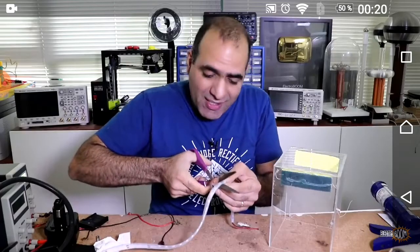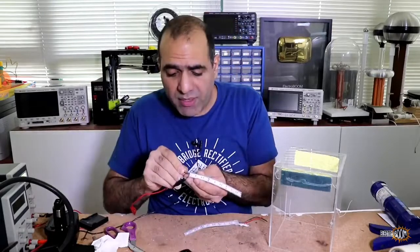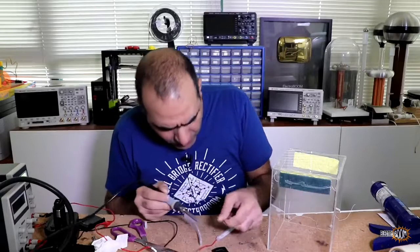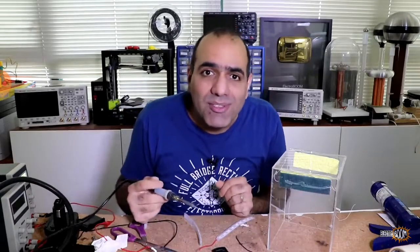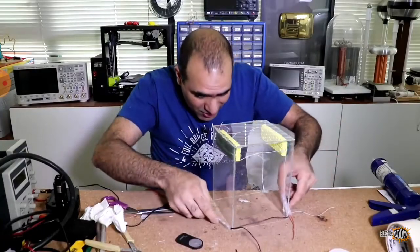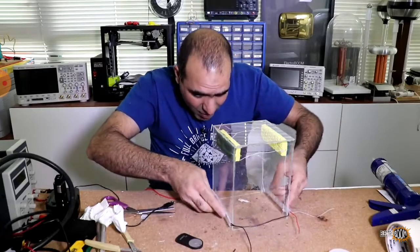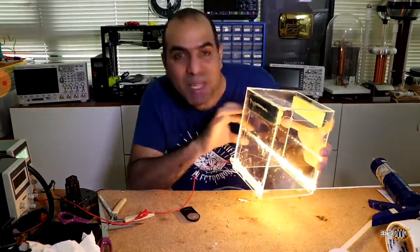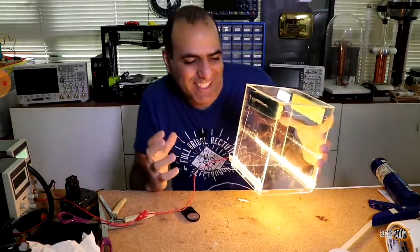So we cut two pieces the length we need. Every piece is still functional at 12 volts. Now we just solder them in series and they'll work at 24 volts. And now we glue our lights to the side of the glass right at the bottom like this. Now when we turn on the light, it will illuminate the mist created on the cold surface.